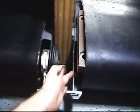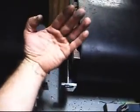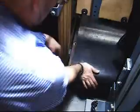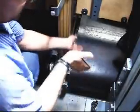Now that I got it out right by the very edge, the edge of this board where it won't hit this side frame here, I'm going to stand it up like a book, on its edge, and pull the top up and out, pull it out to the left side of your screen. Push down with my hand on the bottom of the board and roll it up.